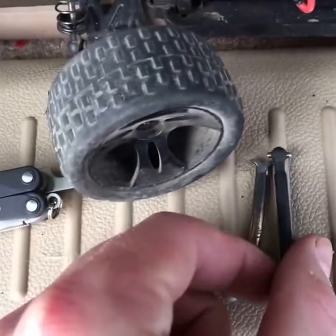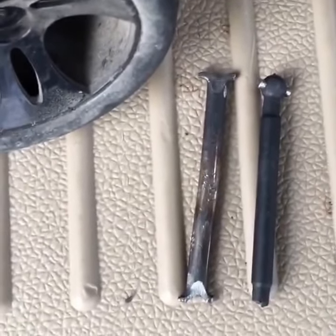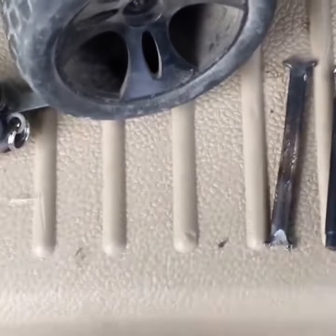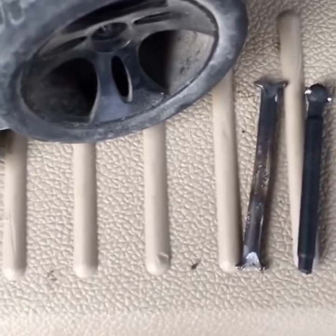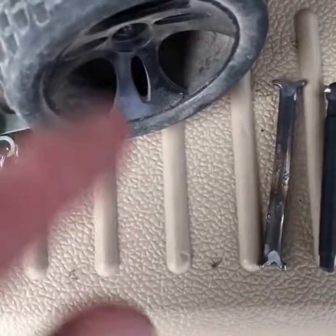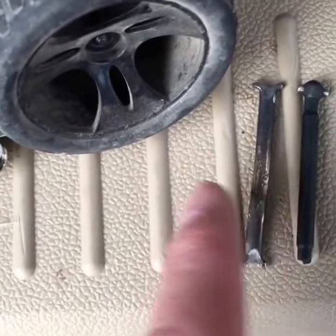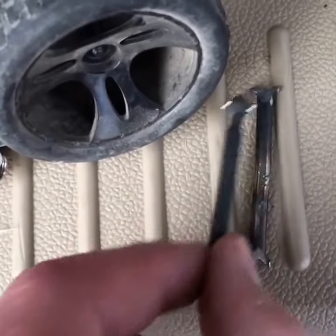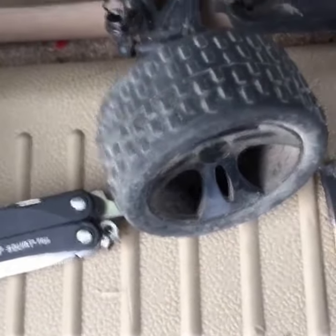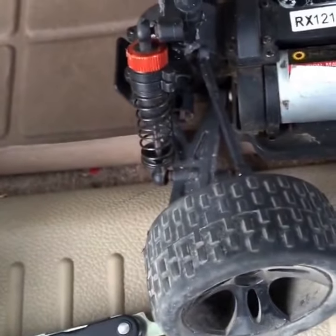And it works really well — I guarantee it won't break now. Basically, what I did was I took this piece, a three-ring binder, flattened it out on a vise, then I took a drill tool and split the ends down, heated it up with a little torch, and then tapped it with a ball-peen hammer. Just lined it up — never measured anything, just took the original as my little guide to make one. It took me about ten minutes. I'm sure it's going to wear out the little cups and all that, but I've run it for two days now and it seemed to work great.